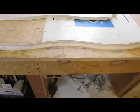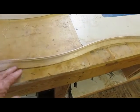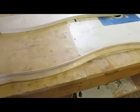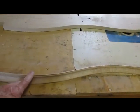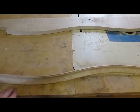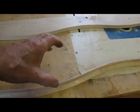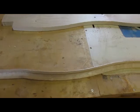I'm about ready to start working on the molding that goes along the bottom edge of the chest. What we have here is a practice piece that I did in soft maple. This one's an inch by 7/8ths, and it follows the curved pattern along the front. It's not high enough — it probably should be an inch and a sixteenth or even an inch and an eighth. The way I made it, it was all one large board, and then after making the molding, I ripped off the back edge.